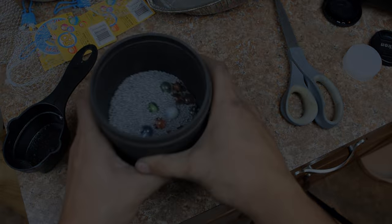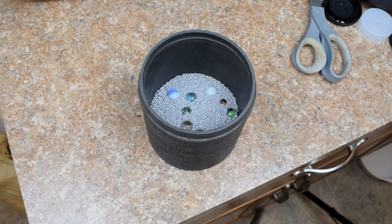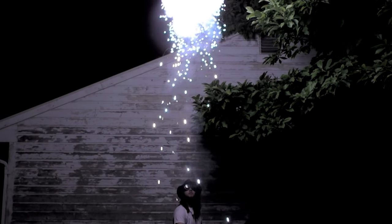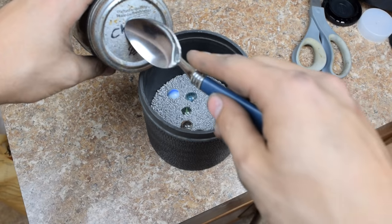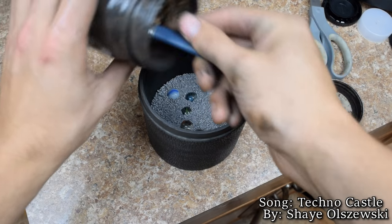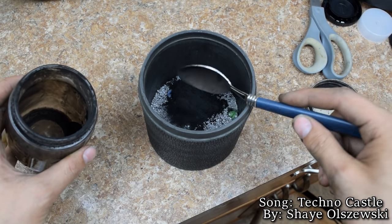The reason we measured how much aluminum we put in is because for about every one cup of aluminum sand, you should add about two tablespoons of charcoal powder. This charcoal powder will coat the granules during milling and help prevent oxidization during the process. This is good because what makes this dark aluminum powder so reactive is the fact that it is, for the most part, un-oxidized. When sufficient heat is applied, it burns off the carbon coating and allows the aluminum underneath to oxidize extremely rapidly, which generates a ton of heat and a bunch of light. If we don't add charcoal, the aluminum will oxidize more while milling and produce a product of inferior quality — containing more non-reactive aluminum oxide instead of fine aluminum powder.